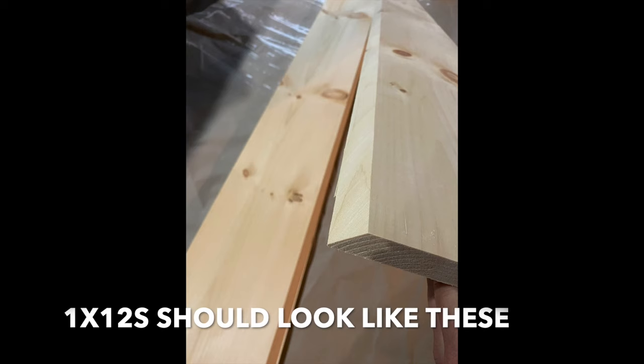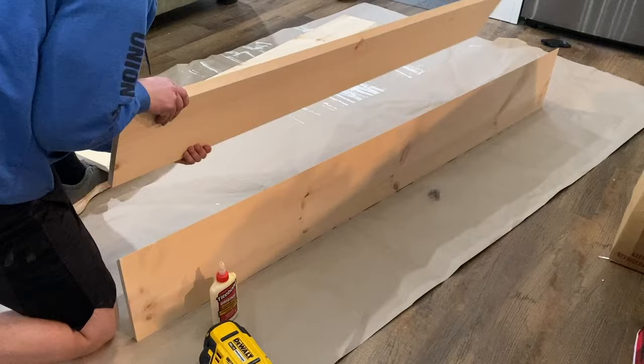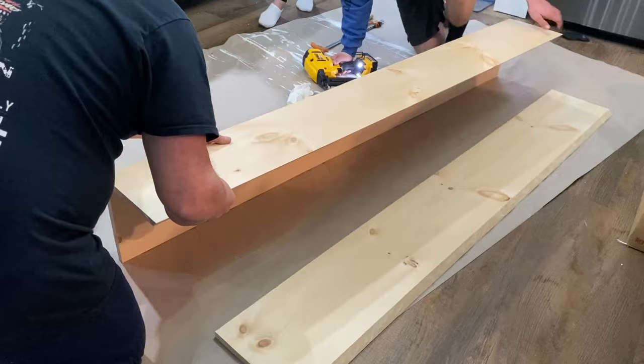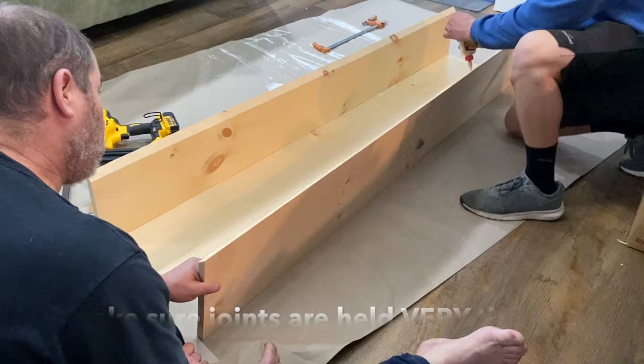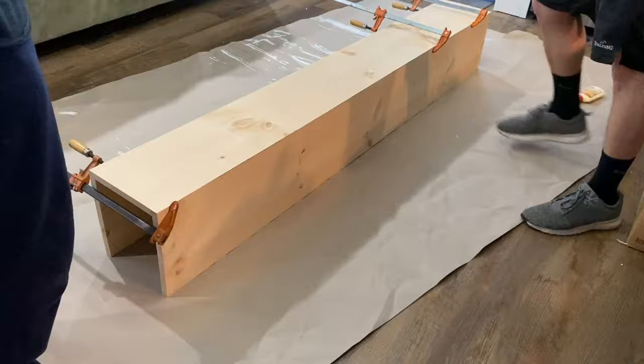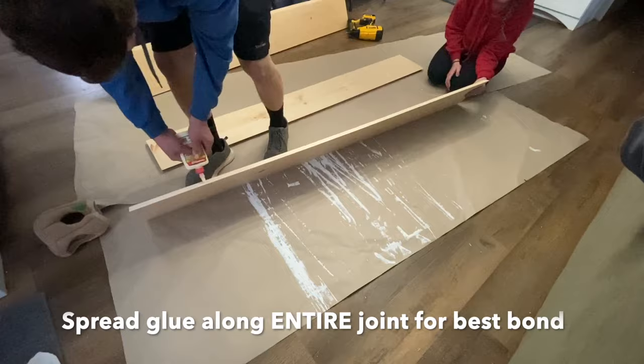Now your boards should look like these. Start gluing up — you definitely want to use plenty of glue. You don't want to over-glue the sides, but use enough to spread it out along the entire surface, especially the outside edge. Once you put everything together and clamp and nail it all, you want little beads of glue to pop out of the corners — that shows you have a good, tight joint and the bond will be a lot stronger after you put the clamps on. Let the beam dry for approximately a couple of hours to make sure everything is set up.